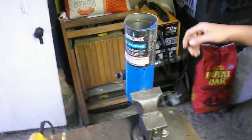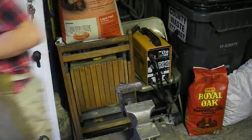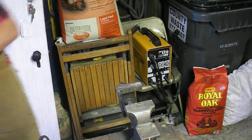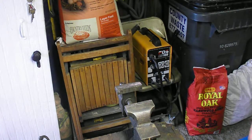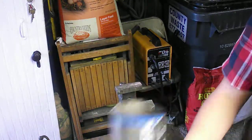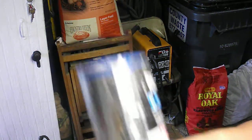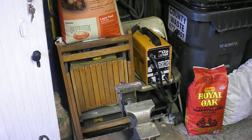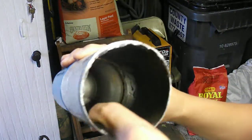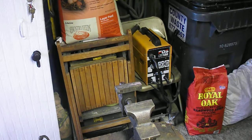Now what you're going to do is just dump out all that water — there's a lot of metal dust in it now. Dump that out. Now you got a crucible — good as new, well, never mind. Anyway, you can use this for melting any kind of metal you can think of if your forge can handle it and it's not too hot. I've melted a couple of these actually. You might want to watch out for this little brass or bronze thing in there where they attach — they just brazed it — that could melt and then you could have a problem, but it should be good for small jobs.